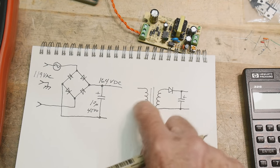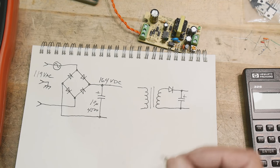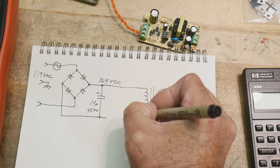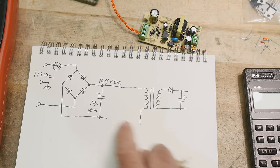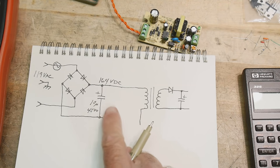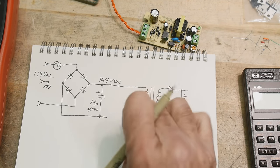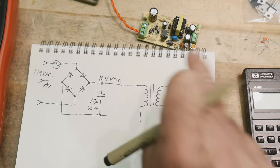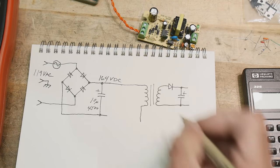And we will have a DC voltage again, all right? And so how do we generate AC volts here? Now, if you watch my series on DC to DC converter, you can bring this down and short these together. Remember when I tapped the wire? You could go tap, tap, tap, and that would create an alternating signal here, which would cause an alternating signal here, which would get rectified and cause a DC voltage over here. All right, so how do we do this?